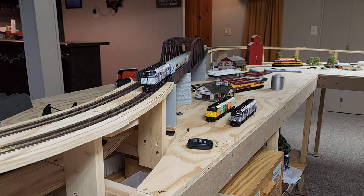Set CV54 to a value of 0. Then get out of programming mode and turn on the bell. We'll say that again, make sure you have plenty of room in front of your locomotive and is not headed for the layout edge and the basement floor. Your F40PH-2D will quickly take off at full speed and gradually slow down to a stop while the decoder reads the motor responses. You'll have fabulous motor control after you do this. If you ever have to reset your locomotive, you can do the automatic adjustment again, it just takes a few seconds.